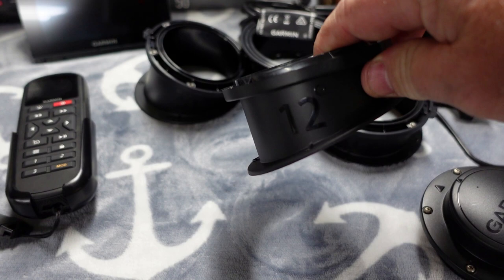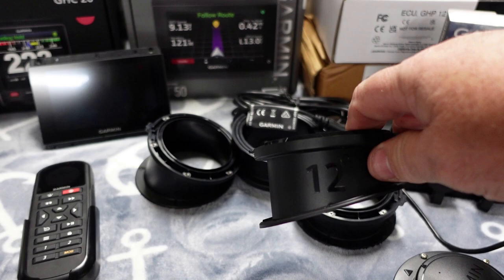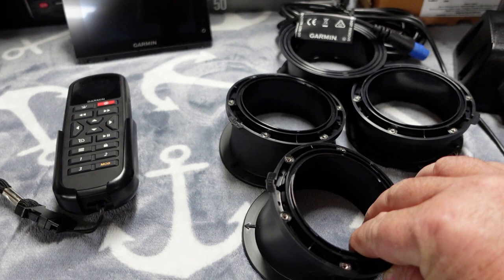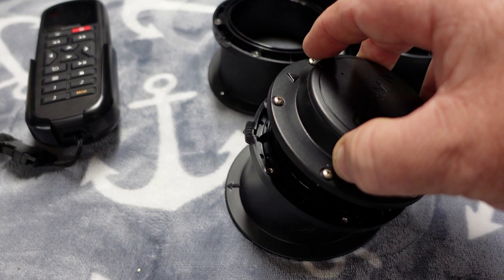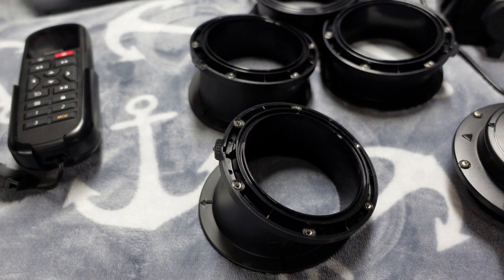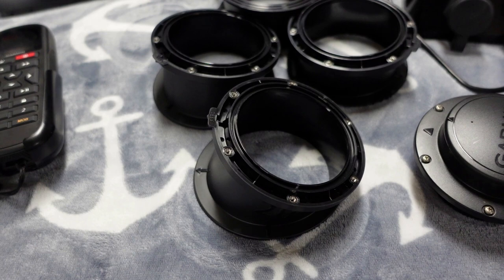If the centerline is here and the hull angle is here, you figure out the dead rise off the centerline and pick out the different angles — you've got a couple of options. You seal this in there, fill it full of antifreeze (or a couple other fluids they recommend), and when you put this in the fluid should overflow. It transmits sound waves through the fluid, through the hull, into the water and back up. It does work — I've installed it in a couple of boats — as long as you have no delaminations or bubbles in the hull. There are a couple ways to test before final installation that you're in the right spot.